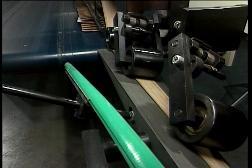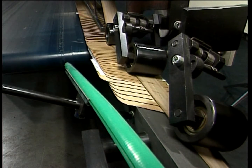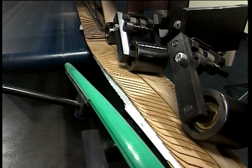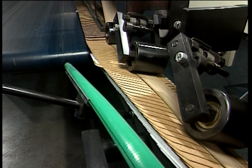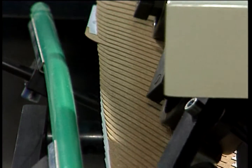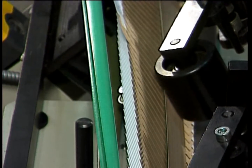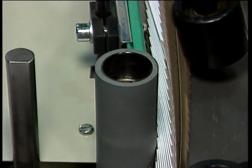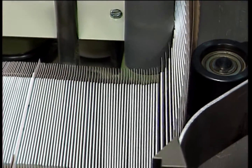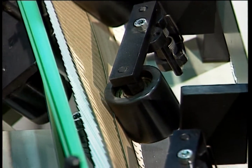The stream of cartons leaves the folding carton gluer's compression and delivery section, passes over a Teflon-coated transfer plate into the FAS 480. As the shingled stream of cartons is drawn into the FAS 480, it is turned carefully by 90 degrees. The top transport belt runs on spring-loaded pressure rollers, which automatically adjusts to suit the thickness of the current stream of cartons.